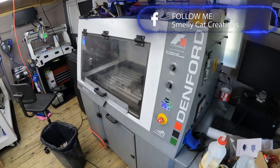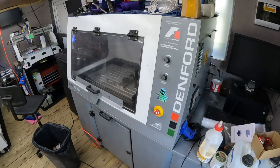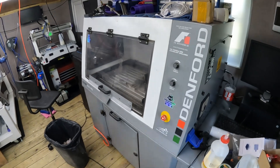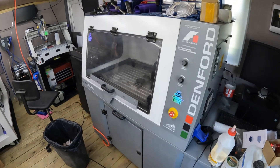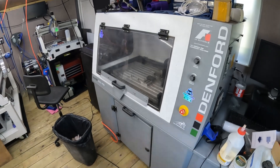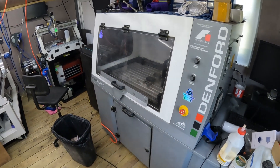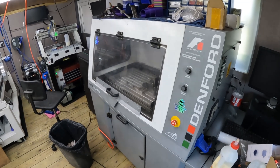The WorkBee is an amazing, capable machine when it comes to machining wood. But my background was in metal, and I very quickly started going back into metalworking on hobbyist machines. It wasn't ideal — it took a lot of adjusting my programs, fighting against slack, backlash, not a powerful enough spindle, and speed. Coming from expensive industrial machines that you could push until cutters would snap, hobby machines just can't do that.